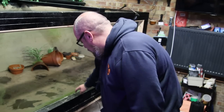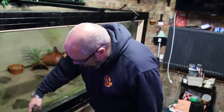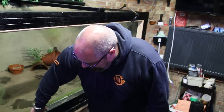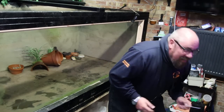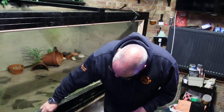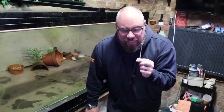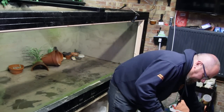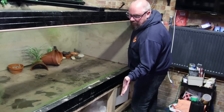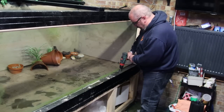What I'm going to do is drill some pilot holes all the way along here, and then just work my way down in sections where I push it back in and drill some big screws through everything — through the two framing pieces, the base of the aquarium, and probably the stand. With a combination of these big massive screws that go all the way down into the stand — they have a tensile strength I'll put on screen — with enough of these, that's going nowhere. So I'm just going to drill some pilot holes along here and work my way down. Once I've got a few in, that'll be enough to hold it back without any water weight, and then I'll go back and add more to give me the stability I need.